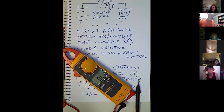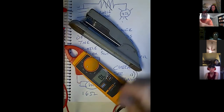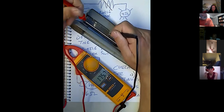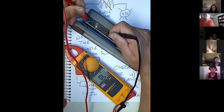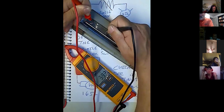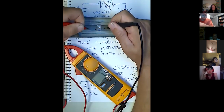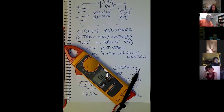The point is we're searching for continuity. If I don't push hard enough, oxidation on the surface keeps it from showing. The continuity checker is useful — you have to press the leads in hard to get through the corrosion on the surface.